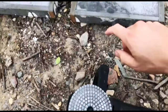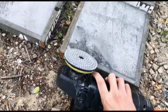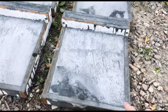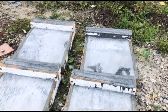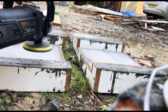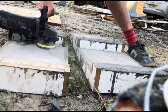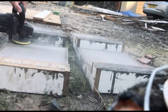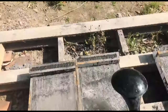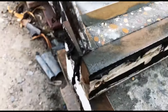I've left the concrete to cure for about two to three days so it's completely solid. I'm using a machine polisher with a 40-grit polishing pad — concrete is very hard to grind — polishing the edges first so the concrete is level against the wood, then grinding across the middle to flatten it out and make it completely smooth, then flattening the lip at the top. First I take off the 40 millimeter piece of shuttering to grind back the unevenness between that and the shelf base. Then I remove all the screws and use a chisel to carefully pry apart the molds to reveal the fully molded shelves.